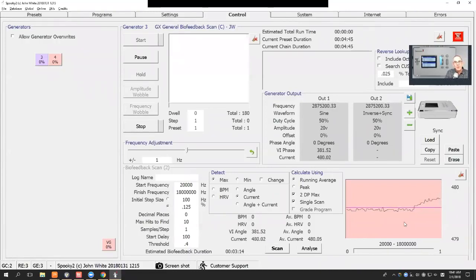Now, because we're in the realms of science, the things to explain do become a little bit more difficult. It's not just a resistor that we're testing, it's a reactive load. The body is not a resistor. The body is predominantly a capacitor, and capacitors at higher frequencies allow more current to pass through them, and so you'll see this increase in the current. But it gets more complex than that. As the frequencies get even higher, the signals bounce off pieces of wire, and you'll also get signals from the Wi-Fi or your TV and other electrical sources showing up. And so you'll get little glitches which you're not sure of.